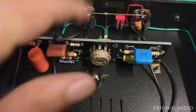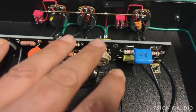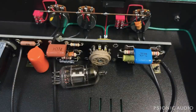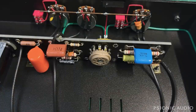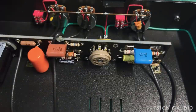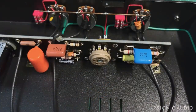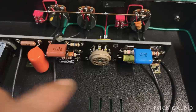So anyway, the three preamp tubes in the amplifier itself are very easy to access. The preamp tube inside this Ceriatone effects loop thing is very difficult because it's got all these screws holding the top panel in place and the things mounted inside the cabinet. It's hard to pull out. So what we decided to do was to put a TAD 7025 inside here where it's all buttoned up. And the JJ that was in here will go into V2 of the main amp. And if that fails down the road, the owner can change that out without taking it to a guy like me.